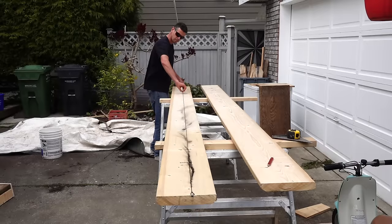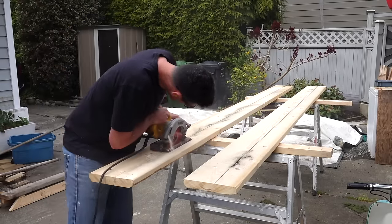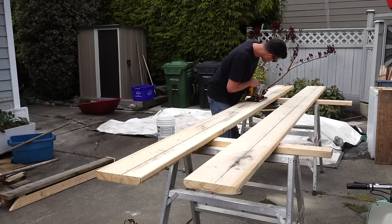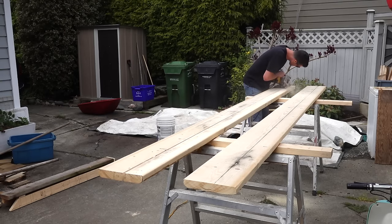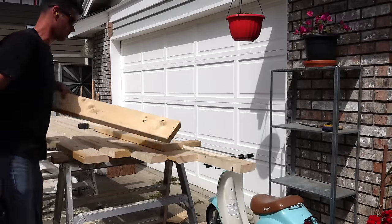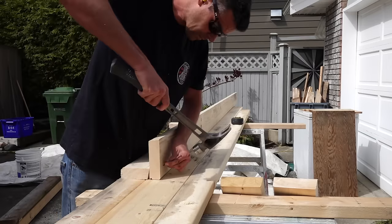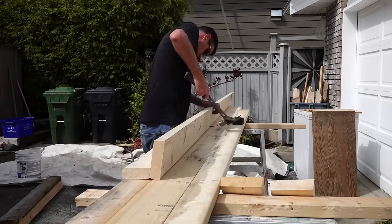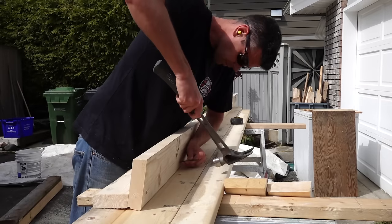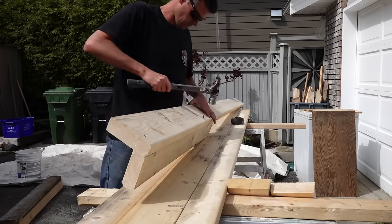Next, chalk a line, set your saw to 10 degrees, and cut it as straight as humanly possible. That angled cut is what will sit on the ground and determine the slope of your curb. I cut everything to length — I joined two pieces to make a 16-foot long curb, so probably a 10-foot and a 6-foot. It looks like I put the sloped part of the cut up and took the off-cut and nailed it to the angled side to form the slope of the curb.